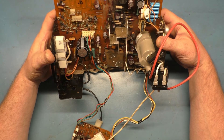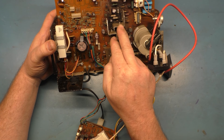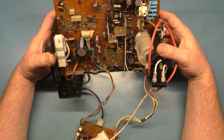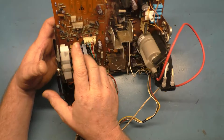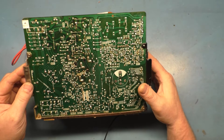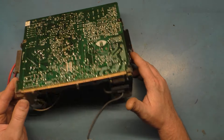So — vertical deflection. There are two control transistors here, or ICs if you will, for the vertical circuit. They reside on these two heat sinks. There are also a couple other resistors and stuff in here, but when you have partial collapse like this it usually means one of these two transistors is bad. So let's show you how to test these transistors and get a good overview of the ease of the process here.